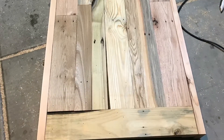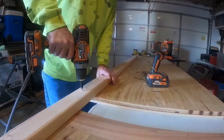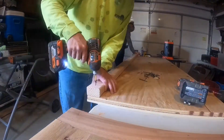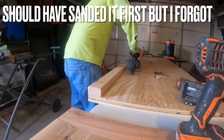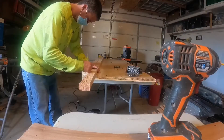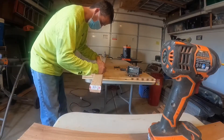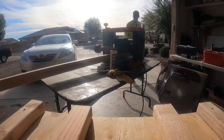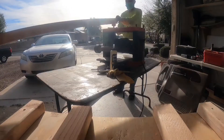Now let's talk about the extension slides and the legs. I flipped the tabletop over and made sure my screws weren't going to be too long. I used 2x3s for the sides and the underneath slides. I pre-drilled the holes to anchor it, then using some glue and screws, anchored that one into place. I sanded down the underside of the plywood so I had a smooth surface for the extensions to slide in and out. Each extension slide took four 2x3s — one for an outer rail, one for an inner rail, and two slides on each side. Once all eight 2x3s were cut to length, I ran the four that were going to be sliding through the planer on all sides to smooth it out and make it slide nicer.